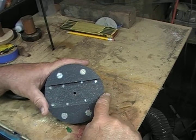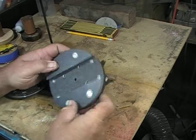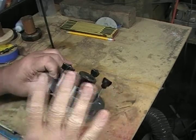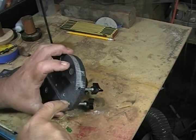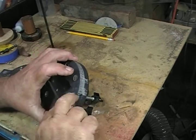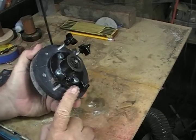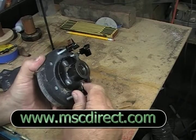Then I had the back plate, the two side plates, all done. I needed to have four lock screws to lock that plate in to keep it from moving when it's going round for round. So at the apex here, I drilled two top, two bottom, tapped them, and put in these screws. These come from MSC Direct and they're under $3 — really handy.